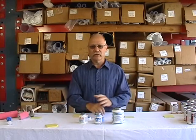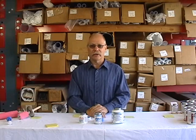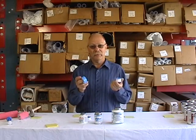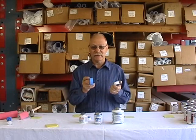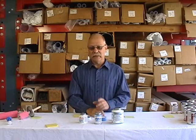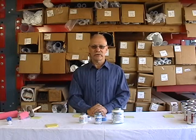I just wanted to make this video to show you the difference. The only time you should be using Teflon tape is on worn threads — when they're really messed up, the tape will fill in the gaps. But you'll actually have fewer leaks on new threads if you use one of the thread sealants. This has been Eric at FlexPVC.com. Thank you very much for watching.